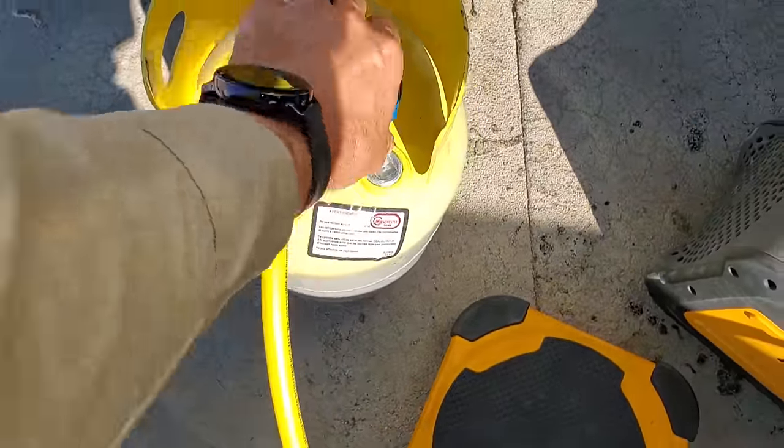I thought it was low on charge, but it actually wasn't. And I almost went down the rabbit hole. I really did kind of go down the rabbit hole of thinking it was low on charge. I even went as far as hooking up my refrigerant cylinder and adding about 4 ounces of refrigerant. And then I was like, wait a minute. Then I looked at that subcooling and I said, this thing isn't low on charge. Then I moved from the discharge port to the liquid port, and I was like, wait a minute, this is weird. And then I realized we were just backing up refrigerant in the condenser is all we were doing. So crazy. Sometimes you just got to decipher this crazy stuff.